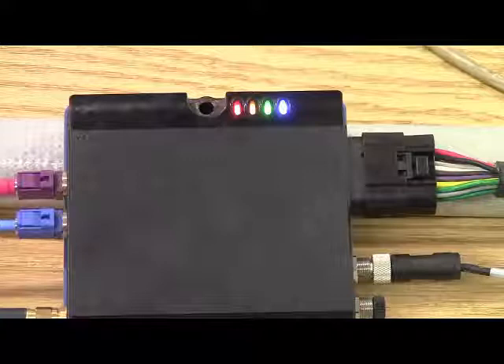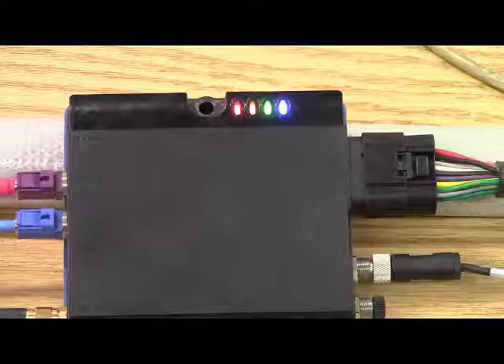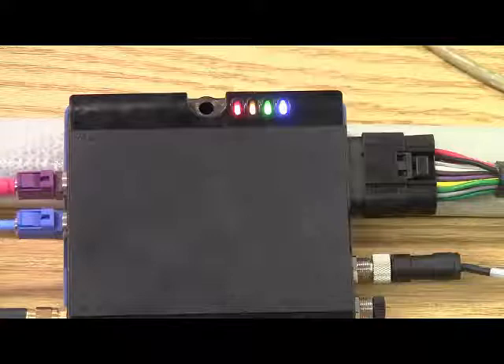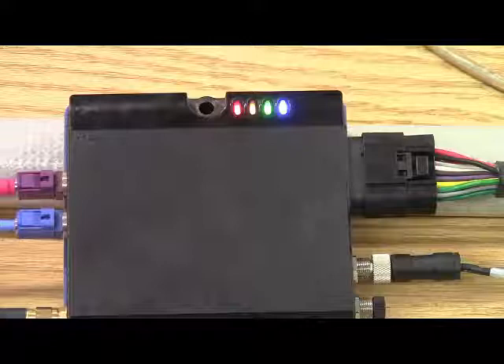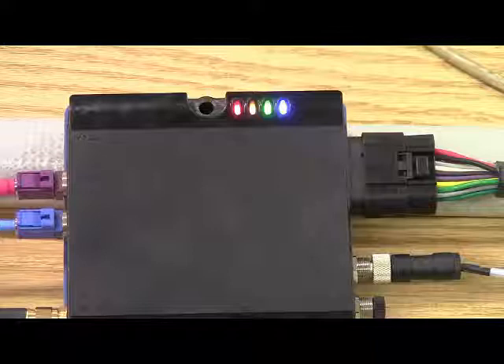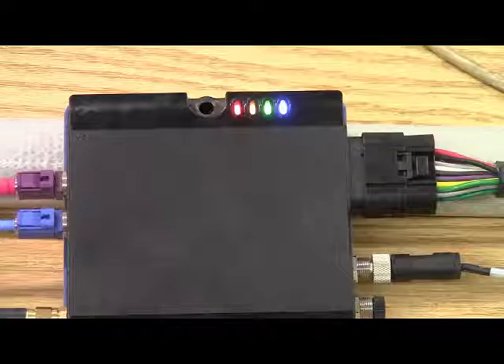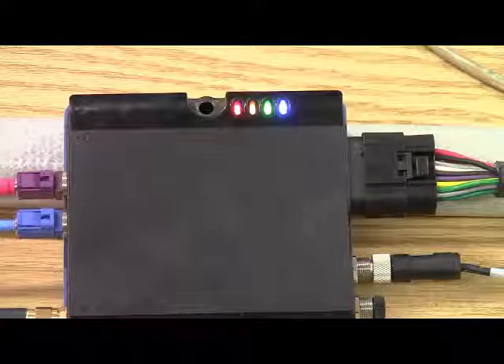When the CL55 is connected, you'll see four LED lights on the front of the box. The red LED indicates the CL55 has power — it will go out when switched power is turned off, but the CL55 will stay powered for up to a minute before shutting down, as it has internal battery power for future diagnostic features. The amber light indicates a cellular network connection. The green light indicates a Wi-Fi connection to another CL55 and will go out if out of range of any other CL55-equipped implements. The blue light indicates the CL55 has a GPS position from its connected antenna.